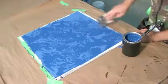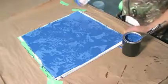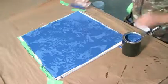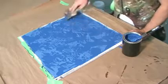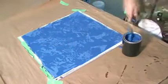When a few square feet have been covered, simply go back across the area and push the edge of the trowel through the base coat. This will cause any excess base coat to be directed off the surface. This excess base coat can be put back into the can and reused. This removal technique will ensure a uniform and even surface.